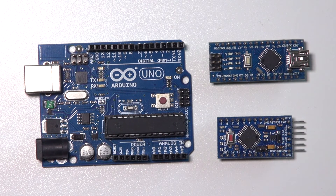If you're looking for an Arduino that easily fits into a breadboard and has the most inputs and outputs of these three — there's also the Mega which has even more — then I recommend the Nano. If power consumption and form factor are really important, consider the Pro Mini. My personal preference is the Nano because it's small, fits in my breadboard, and is easier to work with than the UNO when you're not using expansion shields.